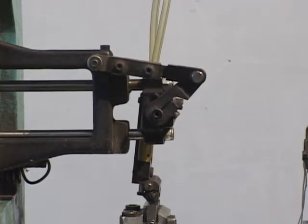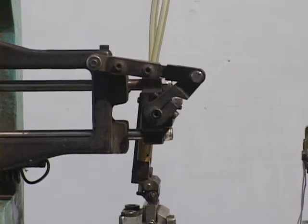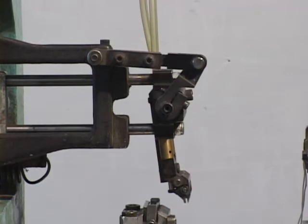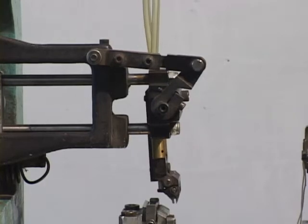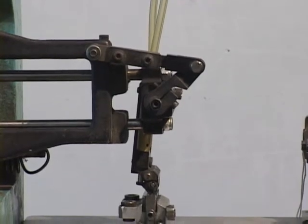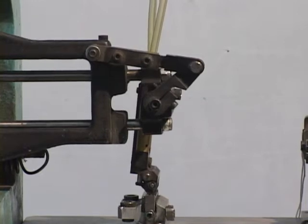So they're using the relative motion between the vertical and horizontal slide to get their rotary motion. So with two cams, both of which are coupled to the wheel that my hand is turning off camera, which you saw before, I'm getting effectively three kinds of motion, two translations and one rotation. And of course, since this is a two-dimensional device, yes, even though it has a third dimension, I'm operating in a 2D plane, you should know from your kinematics that any rigid link in two dimensions has 3 degrees of freedom, two of which are X and Y, and the third is theta, and this mechanism is controlling all three of those and putting the part from one position to the other. This, by the way, is called a pick-and-place mechanism.